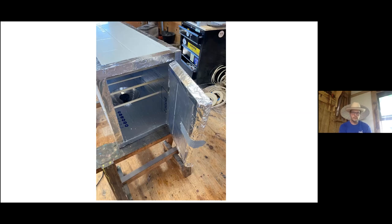Here is the kiln. It's just a styrofoam box with a reptile heat lamp inside and some dowels that hold your parts up off of the heat lamp. For temperature control, just drill holes in the top of it, stick a thermometer in the side, and use the holes to allow some moisture out and regulate the temperature. You could add a rheostat to dial in the temperature, but that's just more to purchase. This thing is about 40 inches long by 16 by 16 inches — nice and easy to travel — and it's 110-volt power.